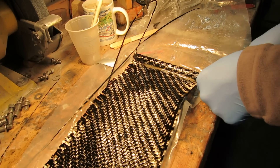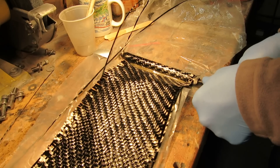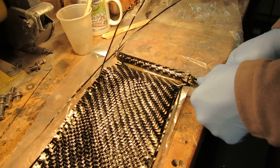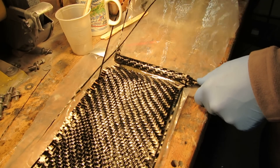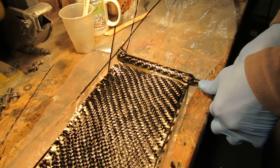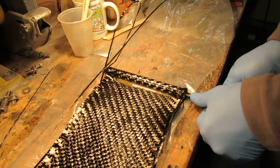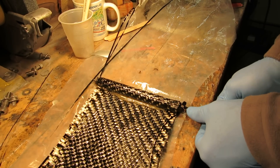You want to make it as hard of a roll as you can, because if you have too much resin in there it will act as a lubricant and it will not be a stable layer of fibers that you essentially have on there.